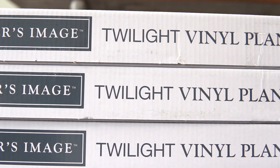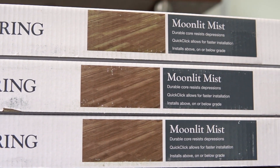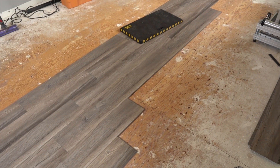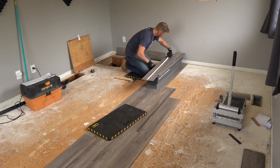For this project we'll be installing Quality Craft's SPC luxury vinyl floors. This vinyl flooring material has a rigid core made from powdered limestone, polyvinyl chloride, and stabilizers. It's dense, dimensionally stable, quiet, and extremely strong.